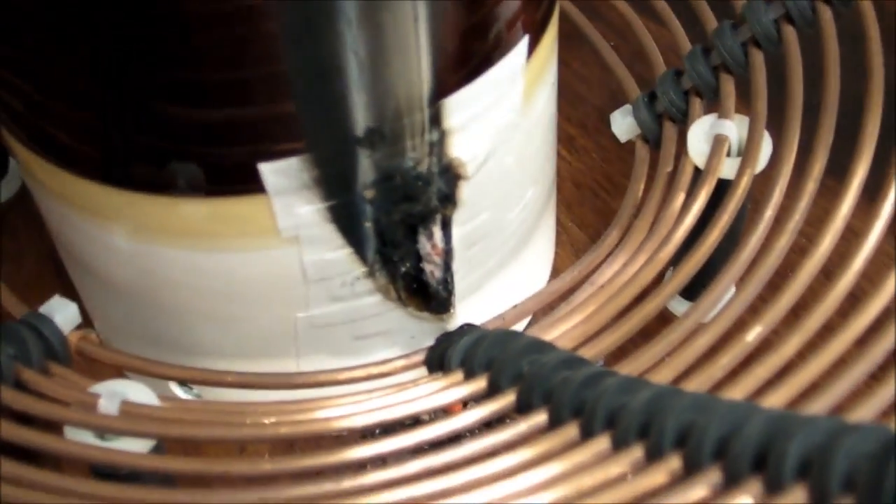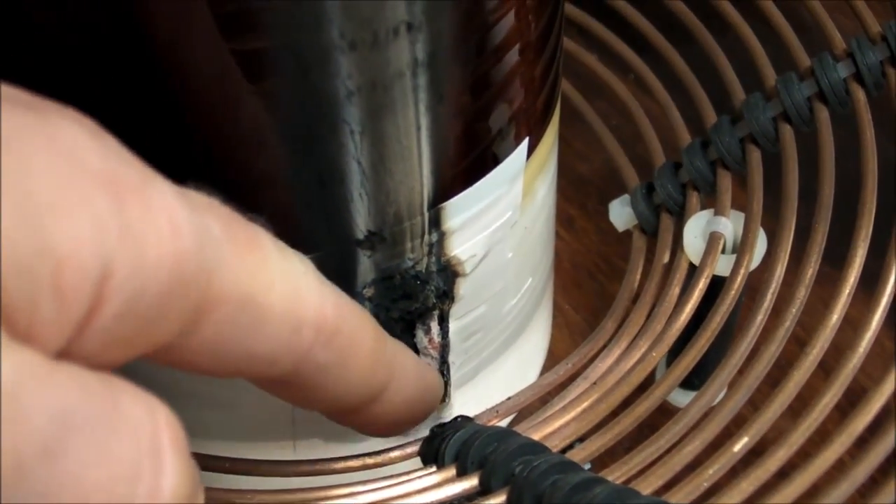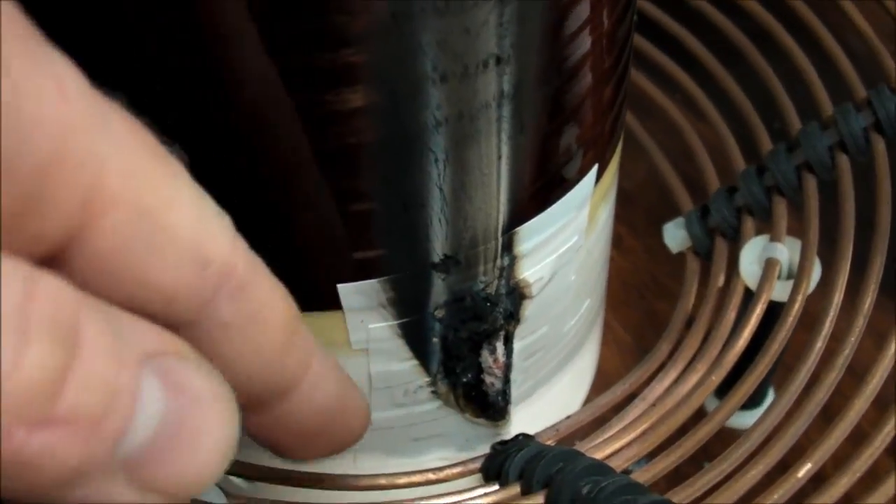That's on the other side, going to the first turn — it's my first-turn tap on the secondary coil, so I can measure that voltage. Usually it's only about a couple hundred volts peak. I was wondering why the heck did that burst right there. Did we get conduction from here to here with only 100 volts and 20 kV of insulation on that orange wire? Well, that's because I forgot to hook up the ground connection to the bottom of the secondary coil.